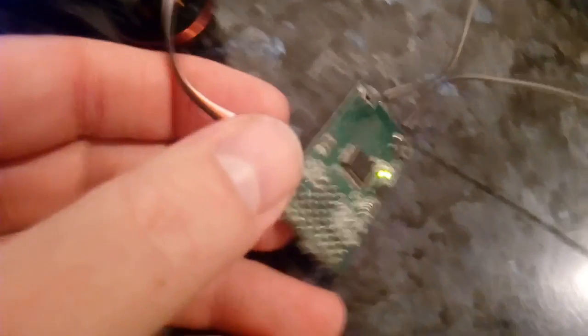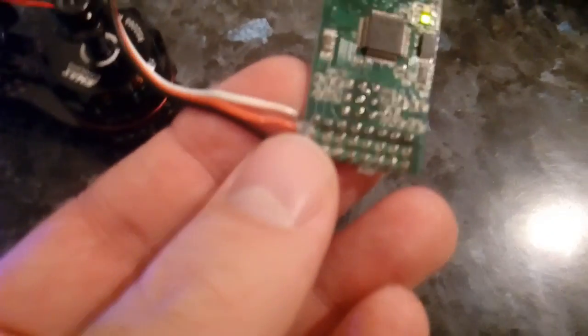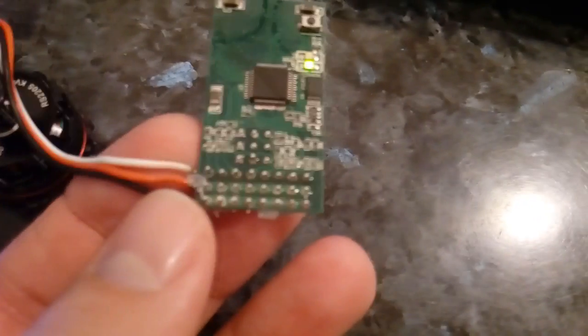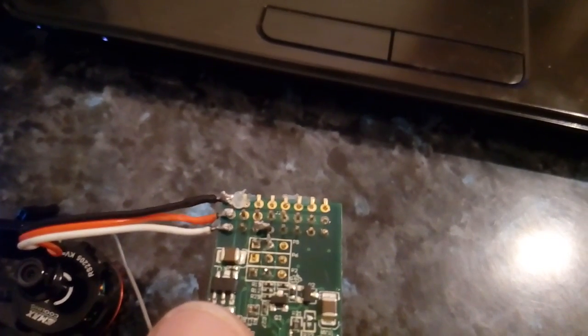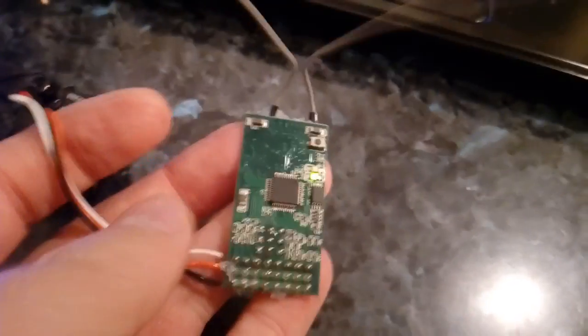I had to shave it in order to fit on my quad. As you can see it's bound with my radio. Pin number 1 is here — these 3 plugs. On the back I shorted pin number 3 and 4 to have PPM output. It's soldered, so pin number 3 and 4 on the signal side, the white wire. As you can see it's working.